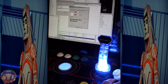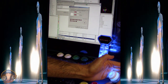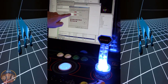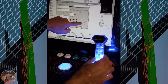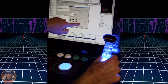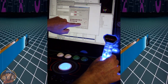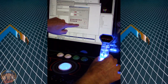And you can see here is the button for the GRS 4-8-way gate switcher. And you can see right now it's set to the blue mode, like so. And in the blue mode, it should be set for 8-way directions. So if you look right here, this is for the analog. Here's a digital, you'll see a red dot. So here's the red dot, and you can see it's able to go to all 8 spots right now. I'm set to the 8 direction mode. Now if you had an Intellivision, it'd be 16, but we don't care about that for these type of machines.